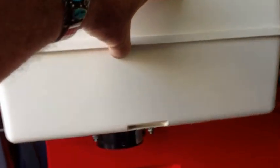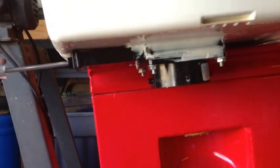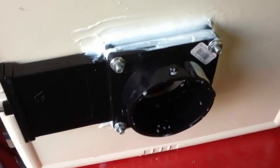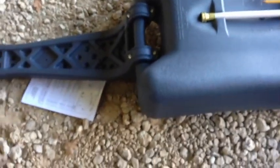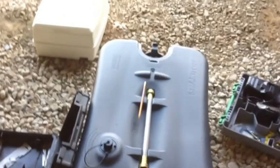I've got rubber washers on the inside around my bolts, and gaskets between each side. That gate valve works perfect. That's the bottom of the holding tank. Now I just build a frame and set this right down flat on a platform. Once it's sitting there, I hook that portable tank up to the bottom. Whenever this small holding tank gets full, just pull this lever, dump it into that, then pick up the handle and roll it right out.